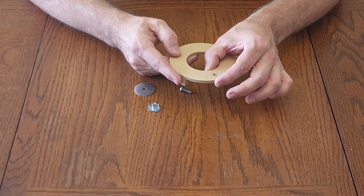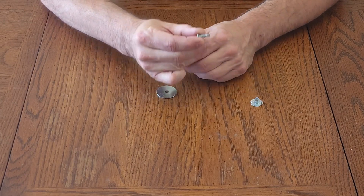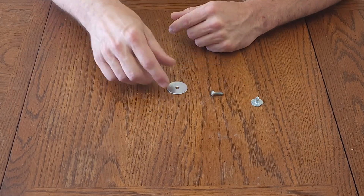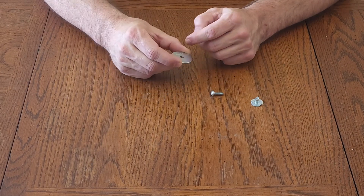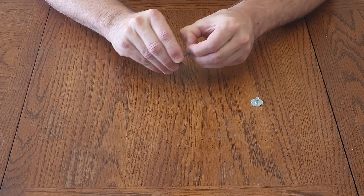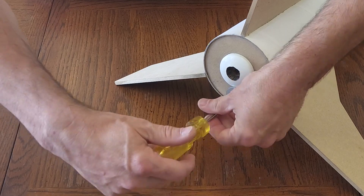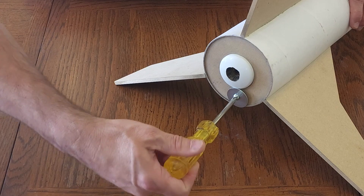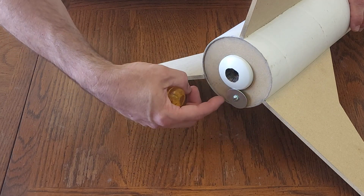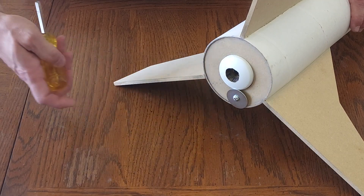For this particular ring — since we're using a four-inch diameter rocket — I just centered the T-nut on the center of the ring. Next we have a small screw: a number 10 screw, or five millimeter if you're in metric, three-quarters of an inch long. The last part is a fender washer — a thin washer with a very large outside diameter compared to its inside hole. This inside hole fits our screw well, and this one is an inch and a quarter outside diameter. With the motor installed, we simply thread the screw with the washer into the T-nut, and as we tighten it down it pushes against the bottom of the motor and holds it in there very nicely. This washer is a little bit large where it pushes against the edge of the body tube, so you could take it on a belt sander and remove a little bit so it pushes against the wood instead of the cardboard.